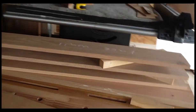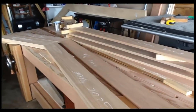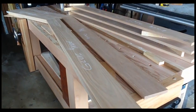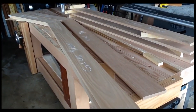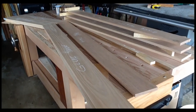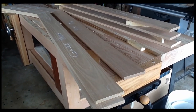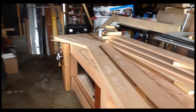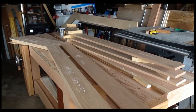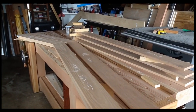I'll show you what happens in the next process. I use a roller when I roll my glue on — I put it on both sides. I don't put a glue side up against a dry side; it's just something I was taught years ago. I've never had a problem. Usually I have one good wet side and the other side is just tacky — doesn't have to be real wet — but it's a better way to alleviate dry spots. This is my preference and it's always served me well. I'll continue the sanding process, then continue clamping it up and I'll be back in a little bit.